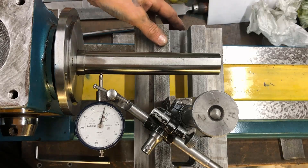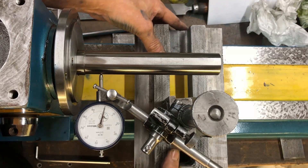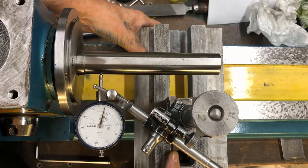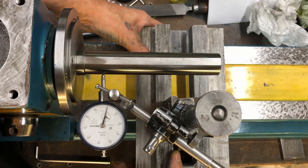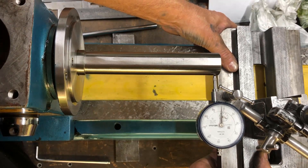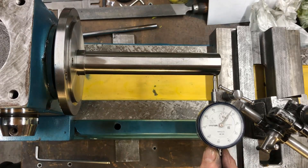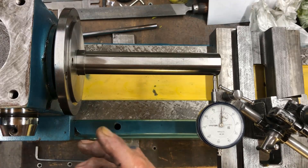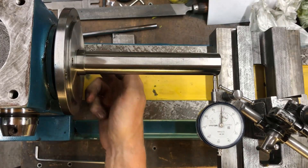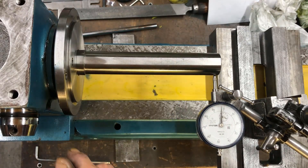Running the carriage loose to the rear way, I've centered it up and down. You can see here when I test it from the inside out, it moves a little bit — in excess of two hundredths of a millimeter, or around one thousandth of an inch — in the wrong direction. That means the headstock needs to be tilted a little bit in that direction, so I have to scrape a little bit off the front on the dovetail.